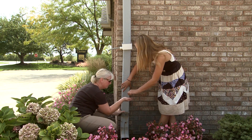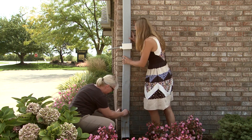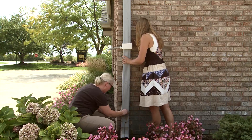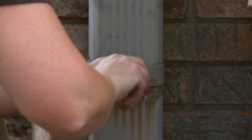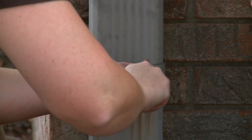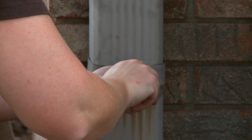The ninth step is to reattach the bottom portion of the downspout to the house — this applies only if you are using a standard diverter or the Save the Rain metal diverter. Fit the downspout into the clip, brace, or strap and replace the screws so that the downspout is once again attached to the house and the diverter is held firmly in place.